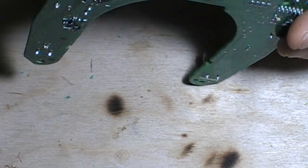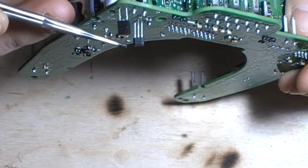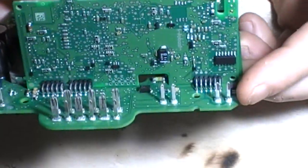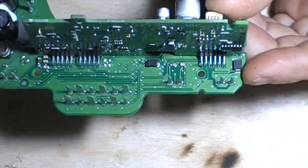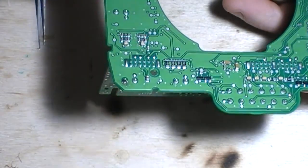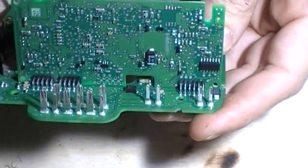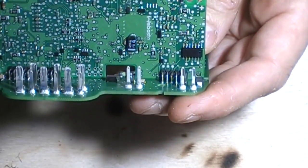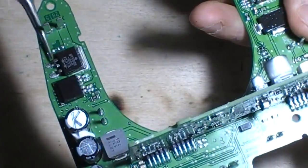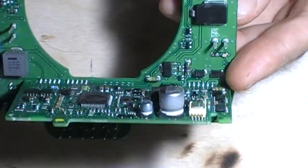On the Air Top board: this is the temperature sensor, and this smaller one here is the hall sensor that senses the fan spinning - so you've got to be careful with that. These pins here: the MOSFET drive for the pump is here. That MOSFET controls the pump. There's also drive for the glow plug and fan. This MOSFET definitely controls the pump - or it could be this one.